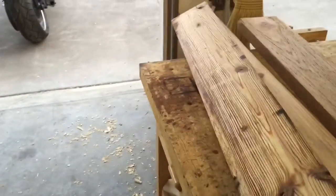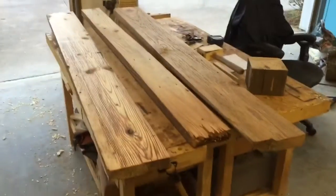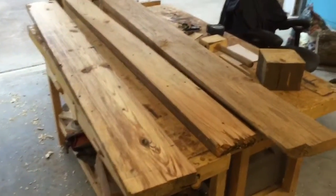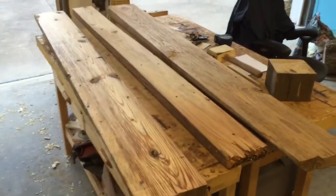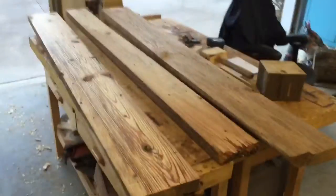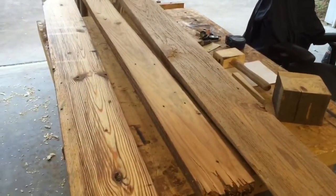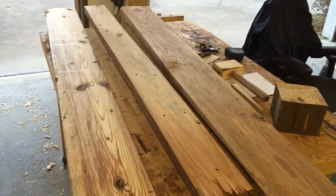What was weird to me is supposedly all this wood was pine. I've been working on some of it and it's really, really pitchy. Some of it is so pitchy that pushing a board or two through the planer would coke the blades up with resin to the point that it wouldn't cut anymore, and you'd have to almost take the thing apart and wash everything down with acetone before you did anything else — there's just so much pitch in it.